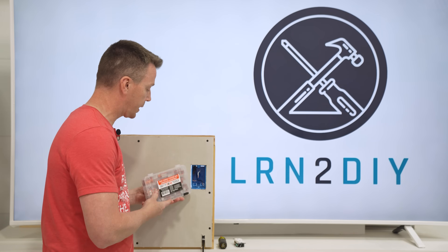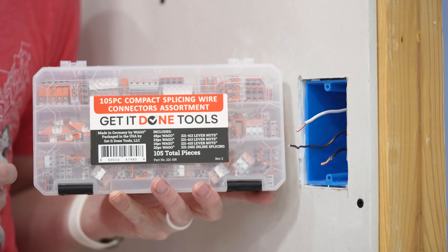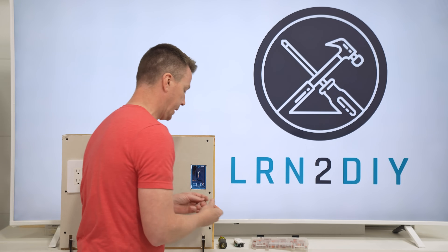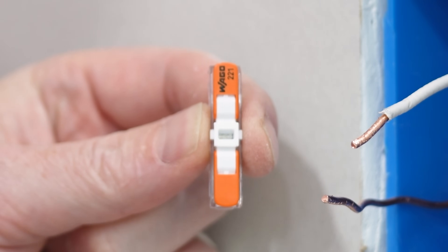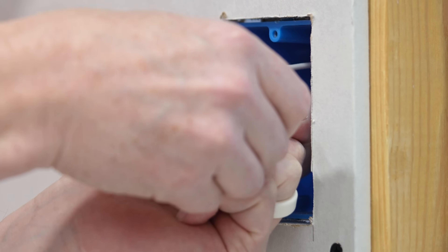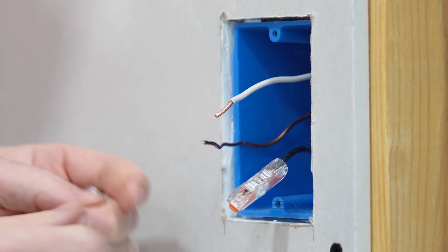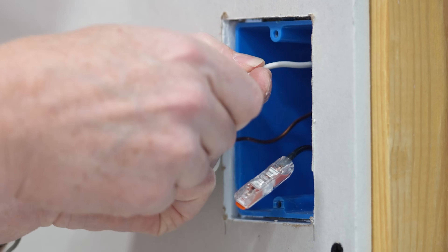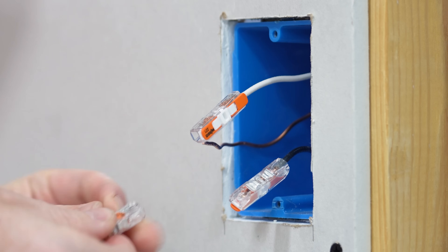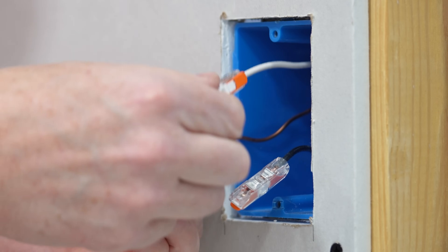For two of these I'm going to use a WAGO kit like this. You're probably familiar with WAGO connectors — these things have been around for decades in Europe and they're very popular here in the United States now, especially with the DIY crowd because they're so easy to use and they work so well. The ones I especially like are these inline connectors, which allow me to extend my wiring right in line without having to do loops or curves. I can attach one right onto here and just like all the other WAGO 221s they have transparent backs so I can see right inside to make sure it's properly connected. I'll open my lever, slide this one all the way in, check the back — yep, that's seated all the way in — then grab a third one for the ground and do the same thing. We have a really good connection here, it's pretty easy to tell.